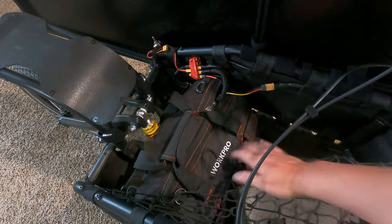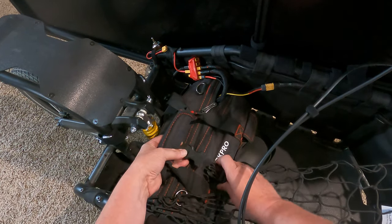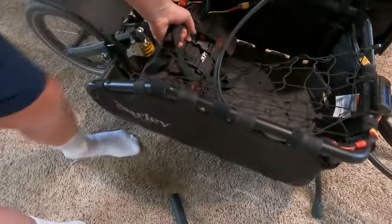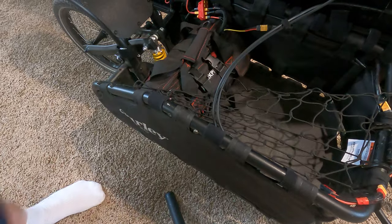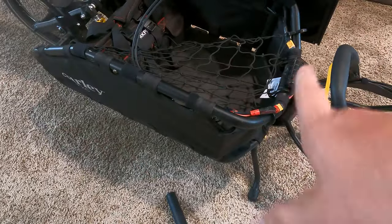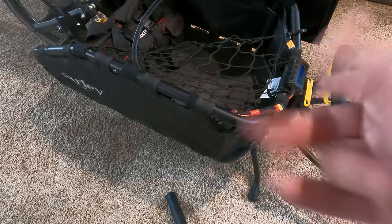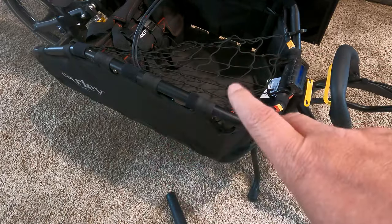After the bag — a basic tool bag — I have straps wrapped around the trailer to keep the batteries from bouncing around. I can pick up the whole trailer by the tool bag, it's that secure. Leftover room is for camping gear and a sleeping pad. Weight distribution is important: if the handlebars are wiggling, you probably have too much weight in the back and need more in the front — you figure that out through touring after a while.